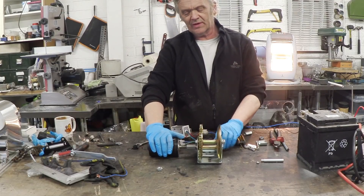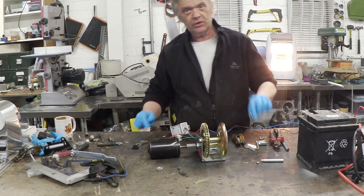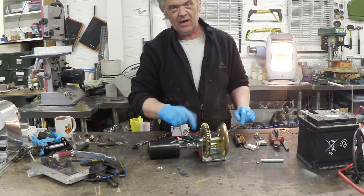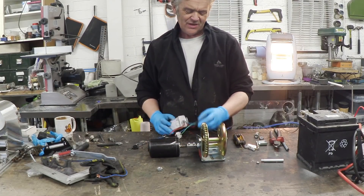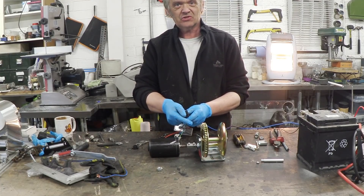Okay so that bit was really easy — all I've done is made a coupling here out of a long nut, just drilled it and threaded it and put a couple of nuts in there, that makes my coupling, attached it to this motor. The motor's actually got a motor speed controller on it now, kind of a cute little thing actually. It goes stop, reverse, stop, forward.